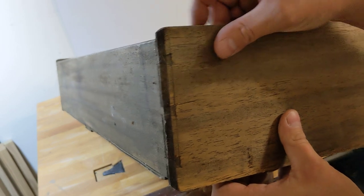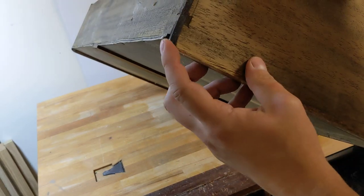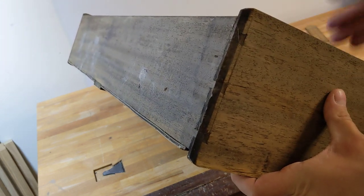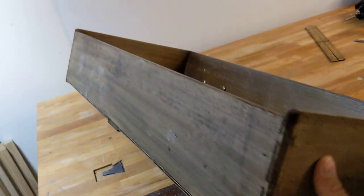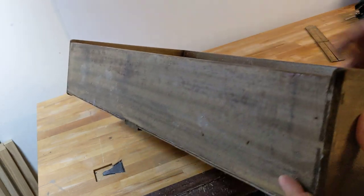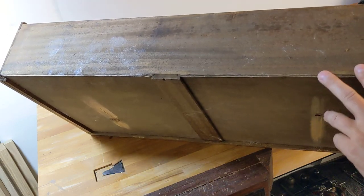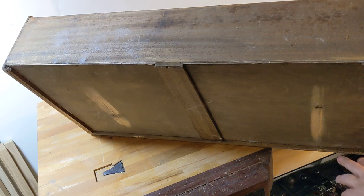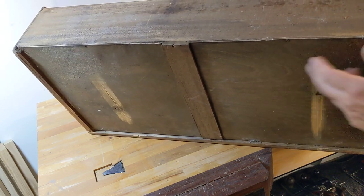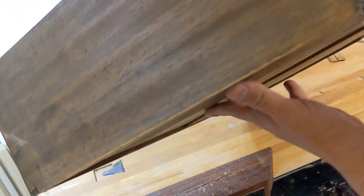Again, a relief there, completely sensible to do that, and a relief underneath. So when you come to put that in, or a client comes to put that into the reveal, it's as easy as can be. The back steps down, and it's rounded over across the top. And then the back, as with most good practice, runs here and it's fixed in the back just by one screw, because it's contained in the grooves. So that's all pretty normal stuff.